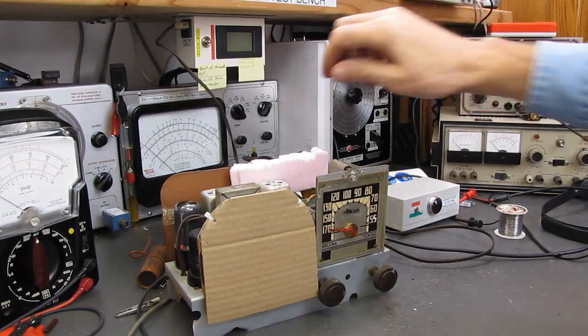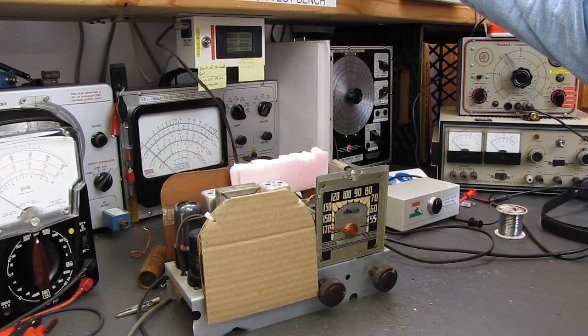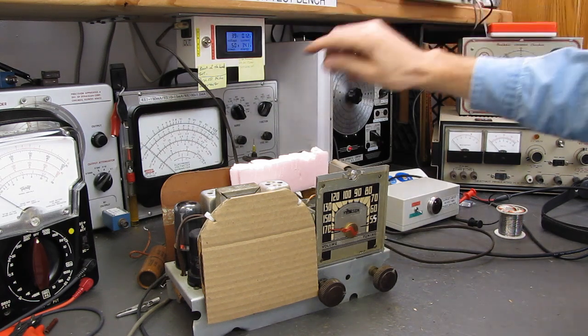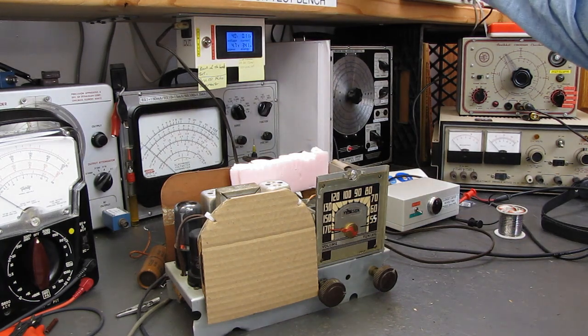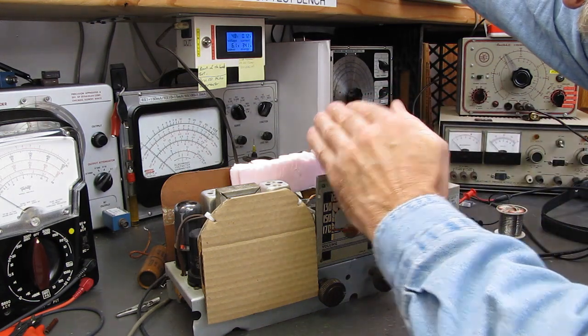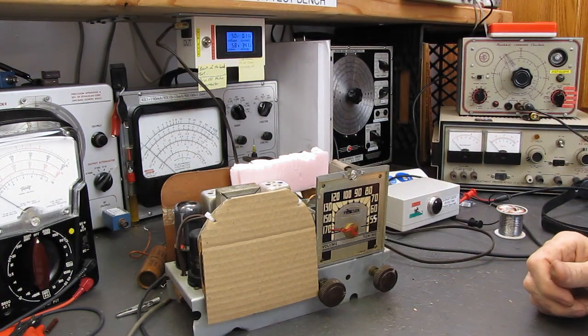It's in frame. The other voltmeter will come alive around 40 volts, give or take. Okay, we've got about 100 milliamperes at 30 volts. So far, so good. We're up at 40 volts. Our other meters come alive, so now I can watch the current down here. 120 milliamps. Still on our dim bulb, of course. I'm starting to see activity. The dial light's starting to work out. Wake up.